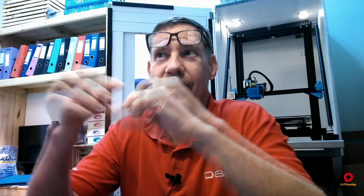In the end, what I ended up doing was saying, all right, so bugger everyone that's telling me that this can't be the issue, because I am now 99.999% sure that my Z-axis is actually the issue. So I started searching on YouTube, Google, everything about Z-axis alignment. And funnily enough, I came across the site that is called Tiny Machines, I'll link it down below, that made a kit that would, with a timing belt and two pulleys, tie your two lead screws together to stop exactly this problem.